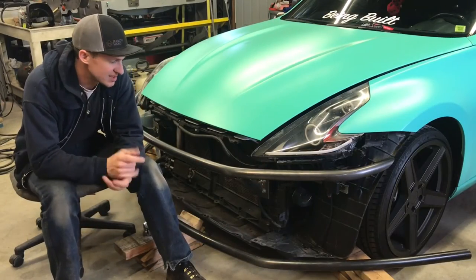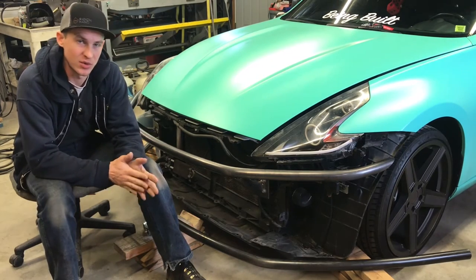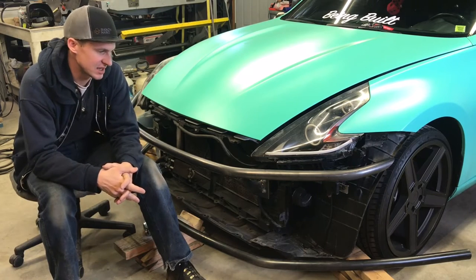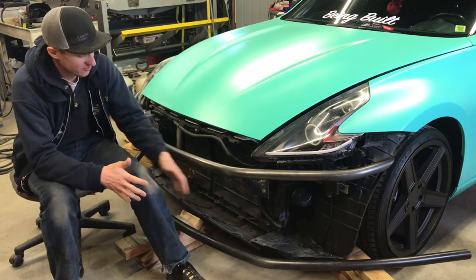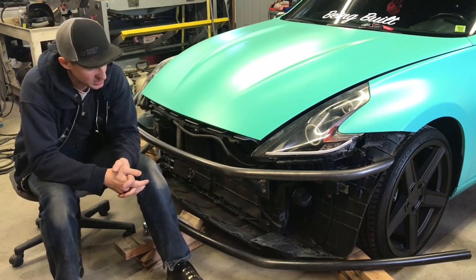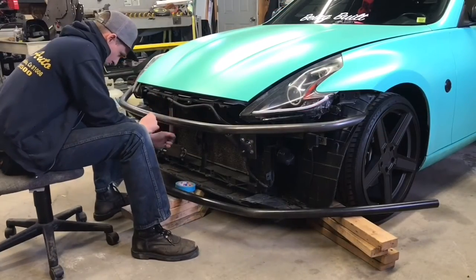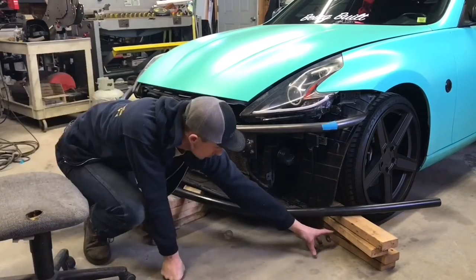All right, at this point, the top tube is pretty much set, and I've got to try to figure out what I'm gonna do with the bottom tube as far as placement front to back, the aesthetic of it, and then once I have it set front to back, I kind of finish how I'm gonna tie in the final bend on the side here, and then we can start working on some of the drop tubes and stuff like that that are gonna mount the two together.